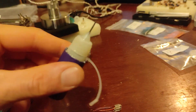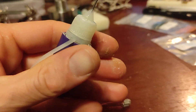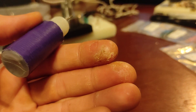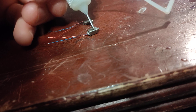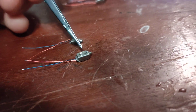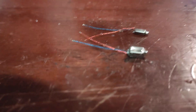What I do is I've got a little bottle here of UV resin — this is actually 3D printer resin. And this is the whole reason why my hands are messed up. Be very careful with this stuff — do not get it on your skin. If you get it on your skin, wash it off immediately. Just be careful with 3D printer resin because it is extremely toxic. Get a little dab of your UV resin. You have to use UV resin because it won't bond until you want it to — that's the whole reason I use UV: it won't glue until I want it to glue.